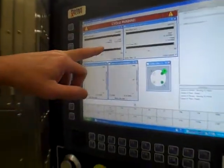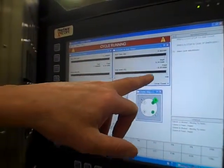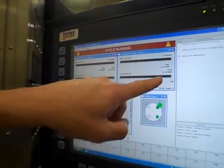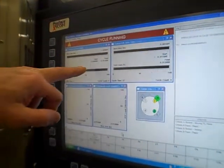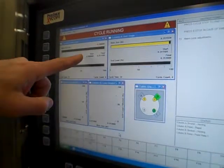Starting at 308, and we're shooting for 311. And on the finished bore, we're starting at 311 and shooting for 312. We're taking 1,000ths off here and 3,000ths off on the rougher. So this one feeds fine, this one feeds coarse.